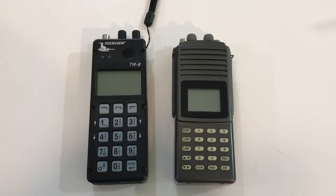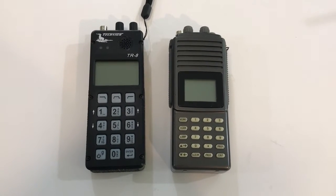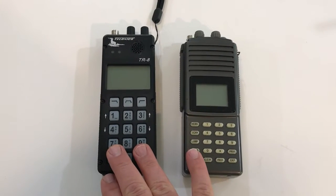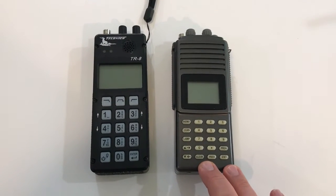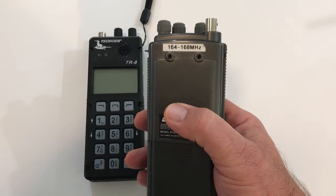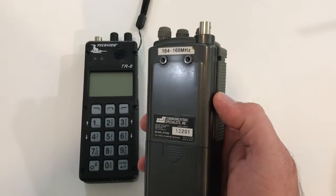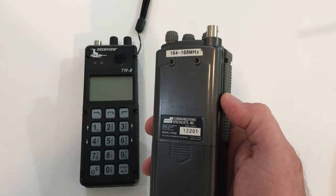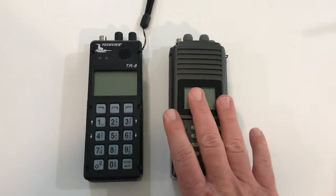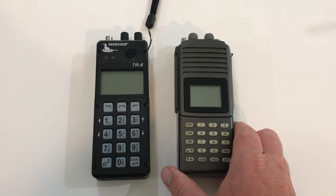I want to show you how to use your handheld radio telemetry receiver during our field exercise. Depending on what's available on a given day, you might find either one of these in your kit. The one on the right is a Communication Specialist model that covers 164 to 168 megahertz. When you purchase these, you have to purchase the specific range of frequencies you need. In our class we're using a 164-based transmitter, so we need this one. For our wildlife research with State Game and Parks, we use 150–151 MHz frequencies.